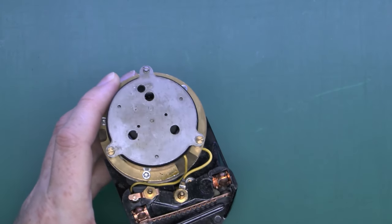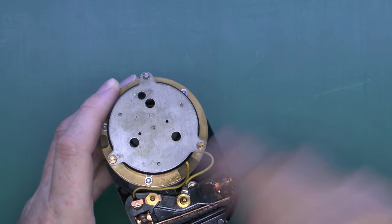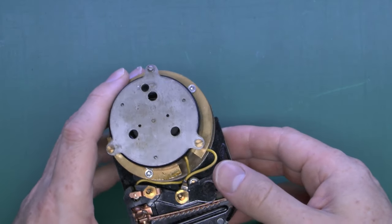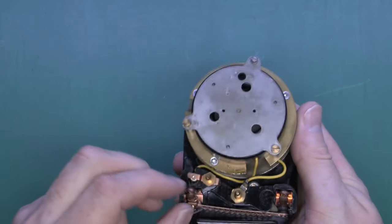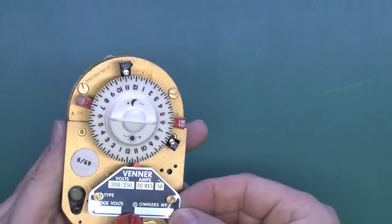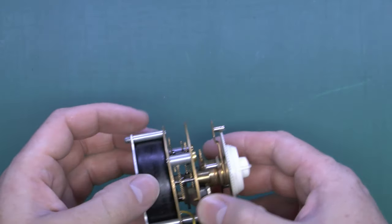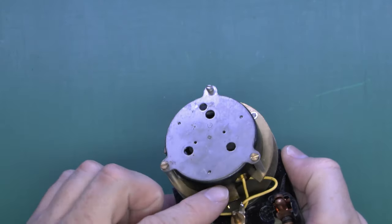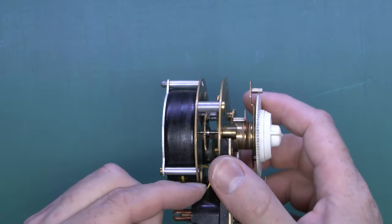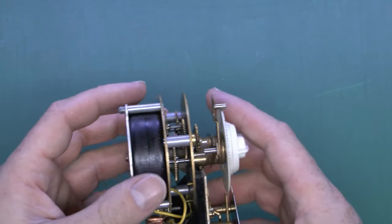On the back of these, it's got these large pins here and then several smaller ones. This is what actually plugs into the back plate, which is made of a similar plastic. So you essentially attach all your wiring to the back plate and then this whole unit just basically plugs in there. So you've got your incoming supply - the line and the neutral - and of course your switched output going out. Essentially the whole back of this, this whole black piece here, is a motor, with a yellow wire just going in the bottom there from the main supply.